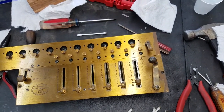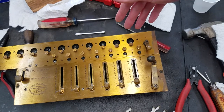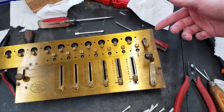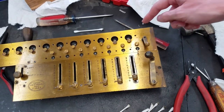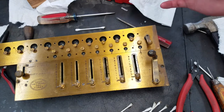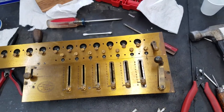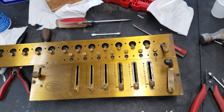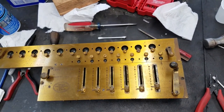The alignment here is not 100% perfect — it's definitely readable. I think that is possibly due to the Maltese cross being removed and the spring drag for overshoot. With the Maltese cross in here, when that cam comes on and locks in it should lock it positively directly in line, but because that's been removed it sometimes locks a little bit off. I really don't understand why they removed it — multiple other arithmometer designs even 100 years after this was made were still using that Maltese cross type thing.